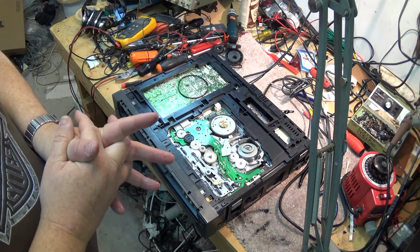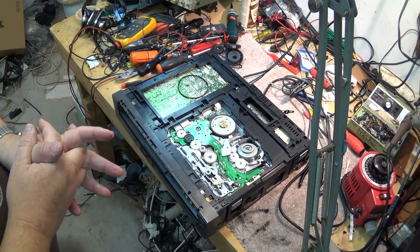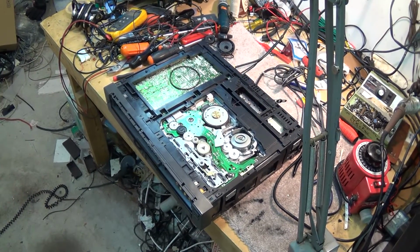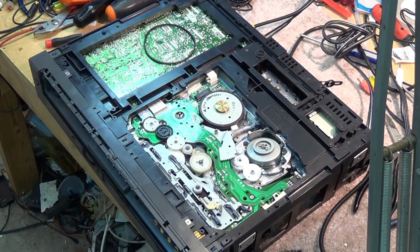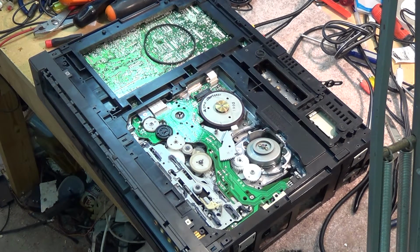They changed the formulation back in the 90s when TF solvents were outlawed by the governments because they contain ozone-depleting chemicals. The manufacturers of cleaning chemicals for electronics had to reformulate their chemicals to get the TF and the CFC solvents and the HCFC solvents out of their products, and we saw a lot of crappy chemicals coming out.